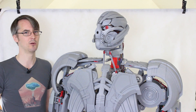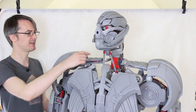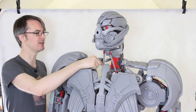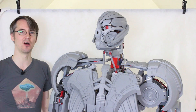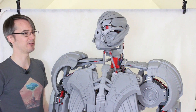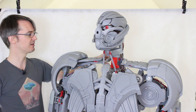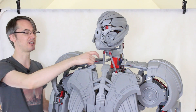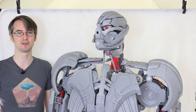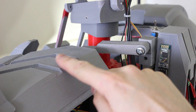His head looks a bit funny now — obviously we need to bolt the neck up and move these shoulder plates. I've left the neck sticks that are pushed by servos the same length. They were always a bit long, which meant he couldn't look down very much, so hopefully he'll be able to look down on people now. I can always adjust those as we go. So let's make some different brackets for these and sort out some flatter neck conduits and mountings. I've fitted some additional brackets above where they were, so that these now sit at an angle.